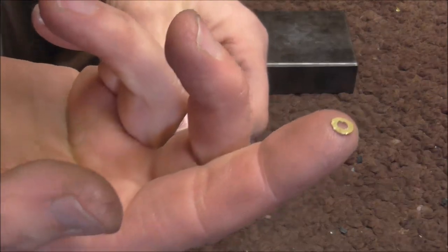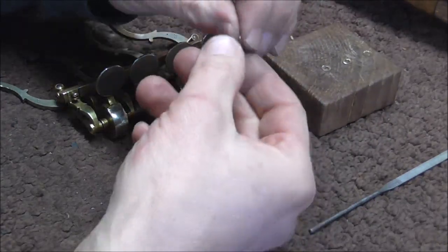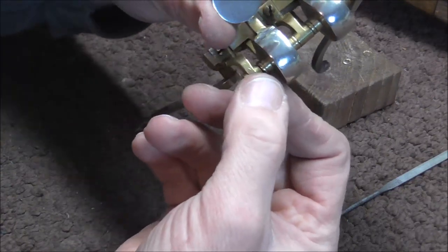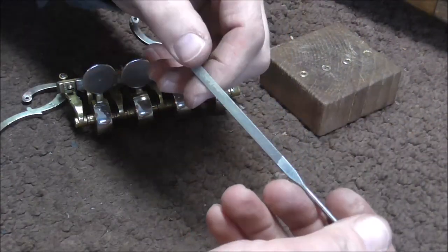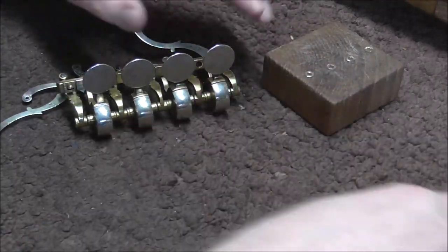There's the little ring, and now I'm going to use the dent hammer to flatten that out. That is ready to go on there. I have all four spacers lined up. What I did to see if they would fit is I took the spacer and put it in the slot, and if it fits, then it should be good. If one of these ends up being a little bit too thick, I'm just going to take the needle file and file it down a little bit.